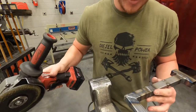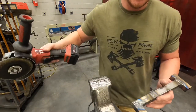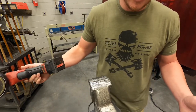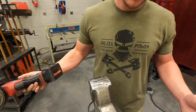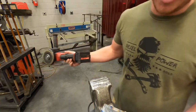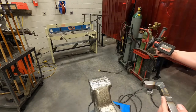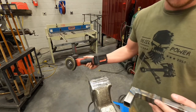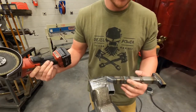Be aware of your surroundings. Make sure wherever you're shooting your sparks, there's nothing flammable in that area and no one standing there. Don't be the person shooting sparks at someone's face. Also, behind me there are a couple of acetylene tanks — you light one of them up and we're just going to be shadows on the wall. So be aware of your area when you're shooting your sparks.